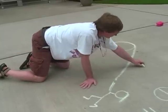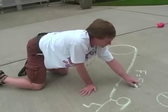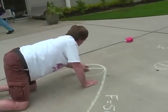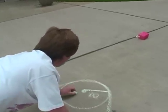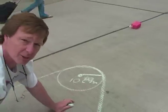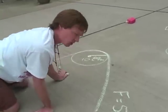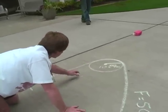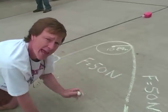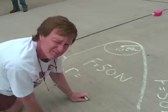Let's say Paris pulls with a force of 50 newtons. Let's say the radius of this pulley is 10 centimeters. Let's write down our knowns and unknowns: we've got an input force of 50 newtons, and we've got an input radius of 10 centimeters — I would convert that to a tenth of a meter, 0.10 m.